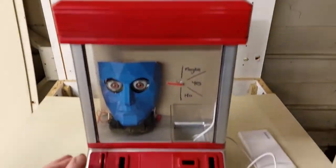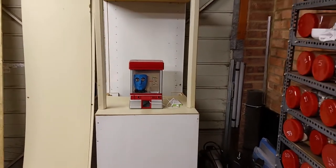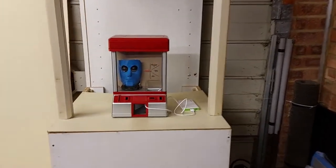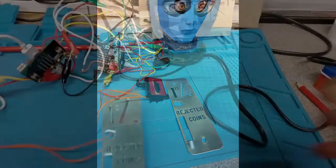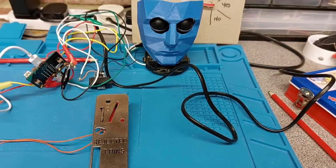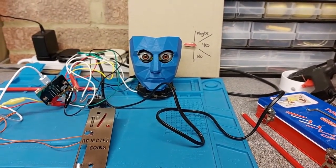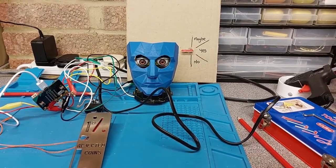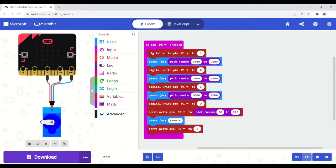So I'm left with this problem: how do we get my little fortune-telling toy that I made earlier this year into something as big as a cabinet? Well, first things first, we have to get the electronics out — I have to break a project, and I hate doing this. You take it all out, test it, make sure it all works. A friend gave me a nice little 1D coin slot plate which I want to incorporate, so I'm fitting the coin mechanism to that — basically just a little micro switch that connects up to the micro:bit. The code for the micro:bit is really simple: it's pin zero for the coin. The micro switch triggered by the insertion of the coin triggers pin zero, and everything cascades from there.